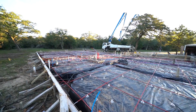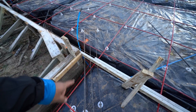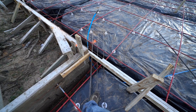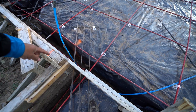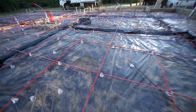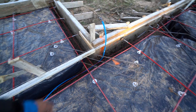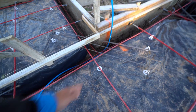Here's one thing that's very important: every time you have what I call an inside corner, you need these diagonal rebars. Cracks will always try to develop from that corner inward, so you always want these diagonals. If you have your slab engineered, that's pretty standard, but don't forget those diagonal bars — you will get a crack right there if you don't put them in. Very important.